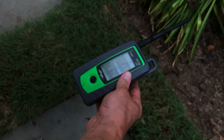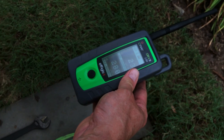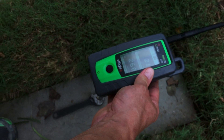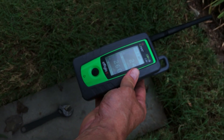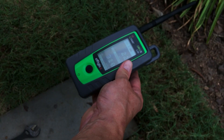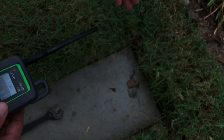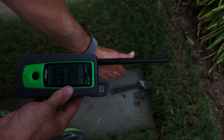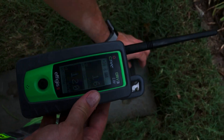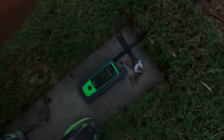I'm going to get a little closer now. 280, 300 microvolts per meter. 270, 240 — it's starting to drop down. 280, 310, 300. So 310 — our max is right here. This is where the wrench was when I found the leak this way, and this is where our leak is. I'll put a marker right here. Our leak is right in this area, underneath this stone. The coax cable is running through here.